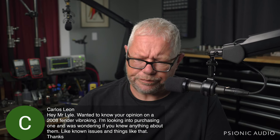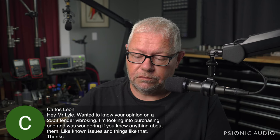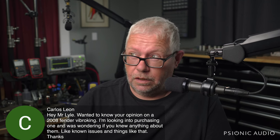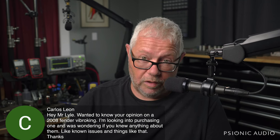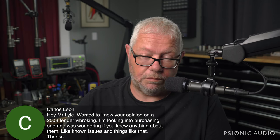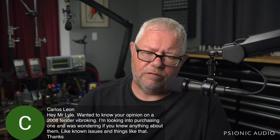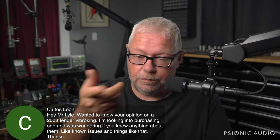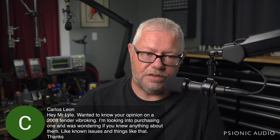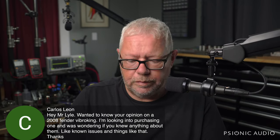It's insulting. All they did was incorrectly strap a Fender 6G-whatever reverb circuit with the wrong driver tube, with the wrong voltages, in front of one channel of a Super Reverb, and they got the input impedance wrong on the Super Reverb, just guaranteed to have noise and buzz issues. I undid all that. It cost the owner an awful lot. He got a great amp, and at the end of it, it still says Fender. So someone looking at that and hearing that amp would say, my God, that sounds great, I'm going to go buy one. Then they get the same piece of junk, the Zinky, foisted on the market. So I don't do that anymore, because it will lead people to make bad decisions.